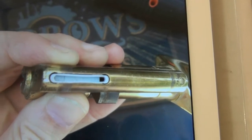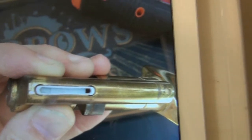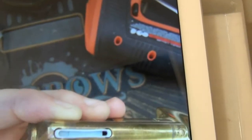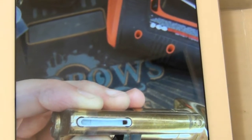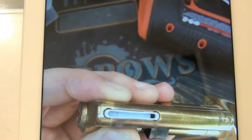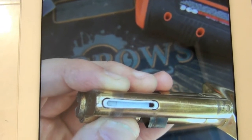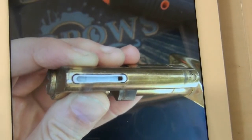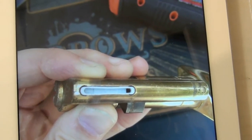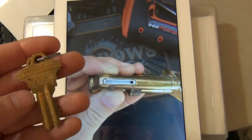There's also a way to test it: when you put the bottom pins in, push them all the way down with a pick or something, with the key in, and see if they turn before you put the top pins in. If it does, it should be okay. Then you can put your top pins in, your springs in, and that cap back on — and the key should work. I hope that helps some people out, since I couldn't find much about that particular aspect of rekeying these.